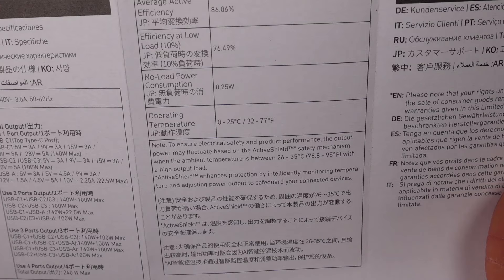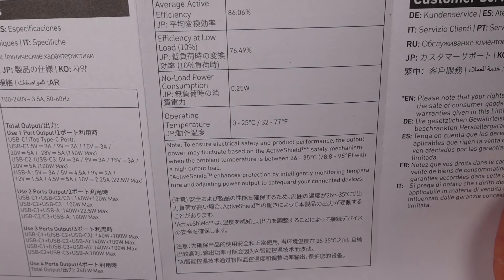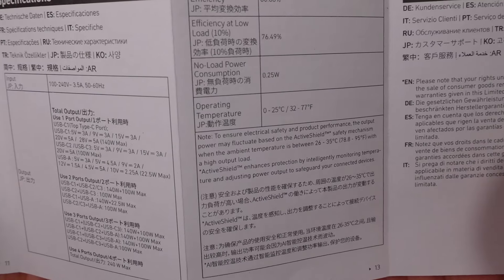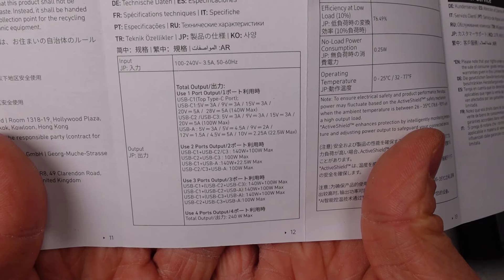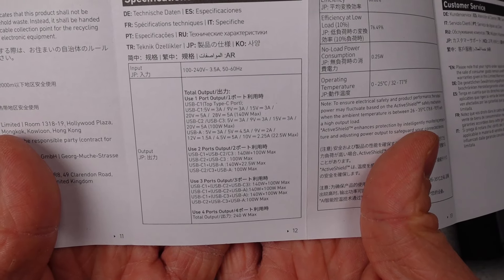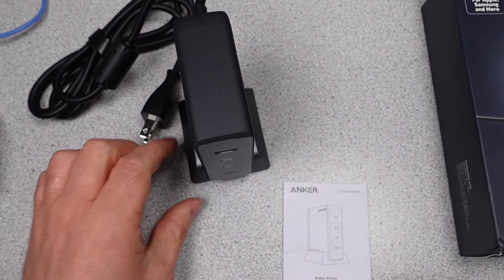The user manual has some claims and modes of operation. There are some specific omissions here that are interesting. This does have some efficiency values as well. If it measured at these values, it wouldn't meet the requirements for energy efficiency standards — but I think these are worst case, assuming a low line voltage like Japan, so probably 85 volts in. The port circuits will be working overtime to make up for that low line voltage. In reality, this adapter gave me a nice surprise: PPS, or programmable power supply modes, were on the table. Not only that, this is the first adapter I found that goes fully to 5 amps in these PPS modes, and can really charge 3 45-watt PPS ports at the same time.